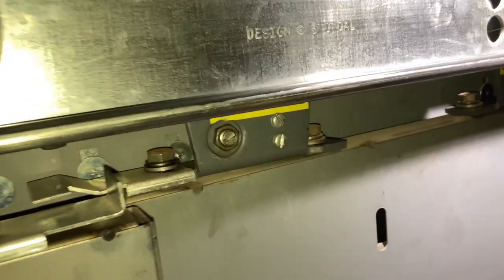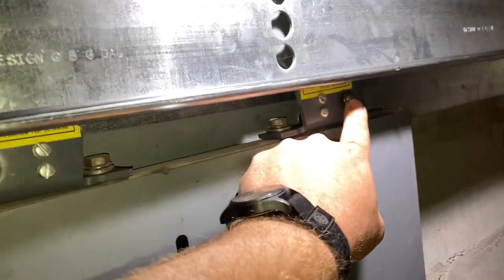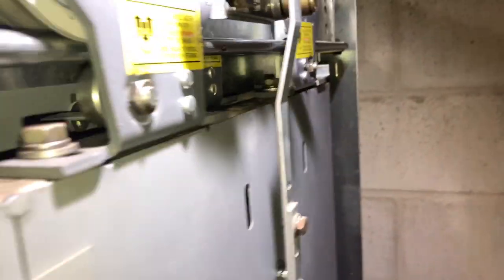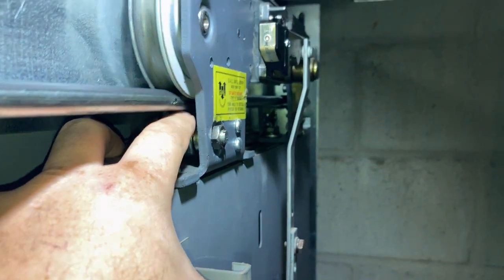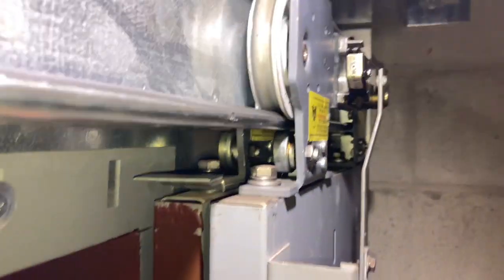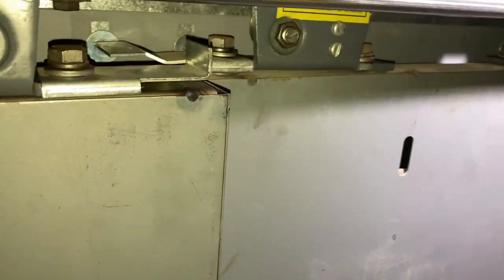The reason I'm here was a phone call — someone looked at the elevator and none of the eccentrics were set on the bottom of these doors. Those two things right there allow no room to get this off, which makes it very difficult to push these doors off the track and keeps them on it.